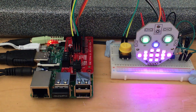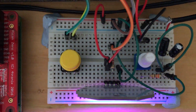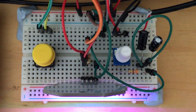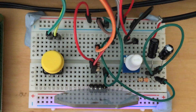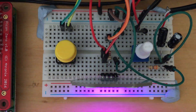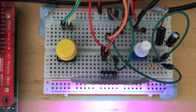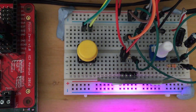Before we do that, let's just have a look around. If my master picks up the camera and moves so that you can see the circuit board behind me, you can see some of the components which make it up. There are two capacitors on the right which extract the audio signal which is fed in from the iMac at present. There is a rotary potentiometer which is used to adjust the rest signal when there is no sound being fed in, and in order to calibrate the circuit there is a yellow button which can be pushed.